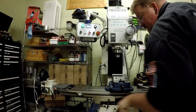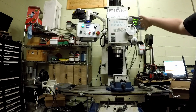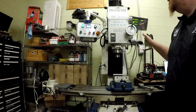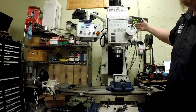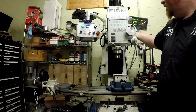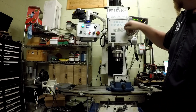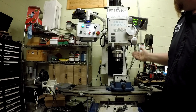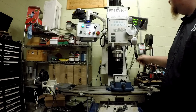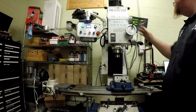This will move the Y, this will move the X. I don't move the Z on this because I can't move the entire head up and down precisely on this machine. Instead, what I use for Z-axis control has its own digital indicator that I can use for accuracy down to approximately half a thousandth. So that's not bad.